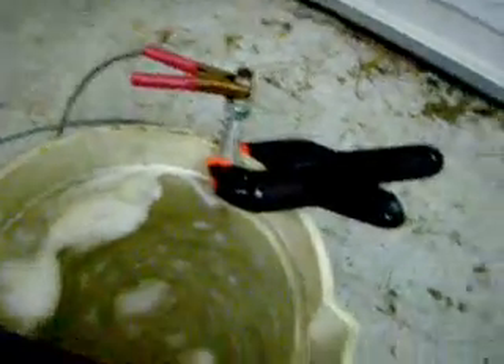We have this solution of baking soda and water that I made using baking soda I swiped out of the freezer, and a common ordinary battery charger. The battery charger's positive lead is connected to a sacrificial steel rod — this is the anode — and the negative lead is connected to the steel part that needs to be de-rusted.